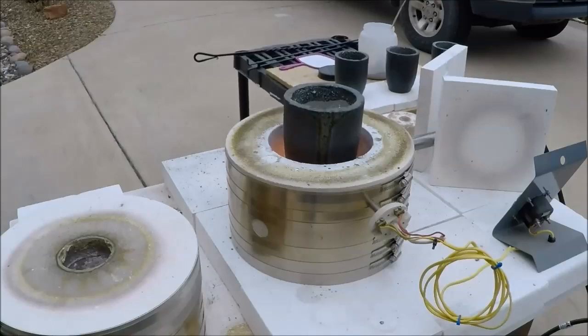Flames still swirling around it, it's still getting plenty warm. It's just that you don't have that immediate room temperature to 2,000 degrees on the inside of your kiln, and that can - quote-unquote - be tough on crucibles because of thermal shock. Now these are clay graphite, and they're a heck of a lot tougher, so you really don't have that much of a thermal shock problem, but they all last a little bit longer if you'll take these extra steps.